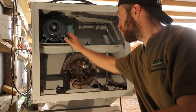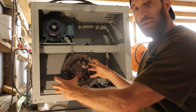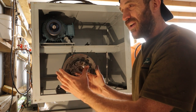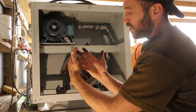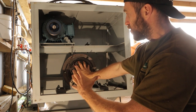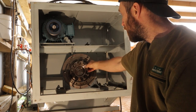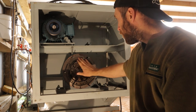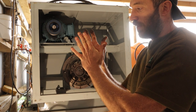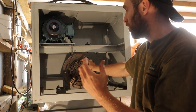This is the drive here — the motor powers it up there, and this is the inside drive. On the outside there's a big housing with a sprocket that goes around the outside of a big one, and as it goes around it spins the smaller one, making the outside housing spin slower, which directly drives the ribbon blender. This has got a whole bunch of sleeves on it, and those sleeves are bone dry, so when they spin on those shafts they'd make a hell of a racket. The shaft on the outside has a few bearings, and shavings get in where those bearings run. You can actually feel the grit when you spin that outside shaft.